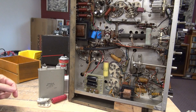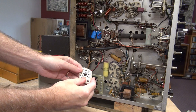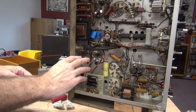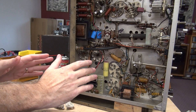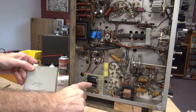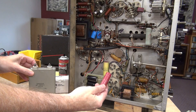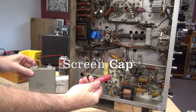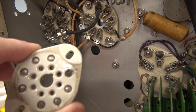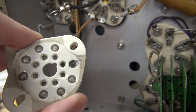In preparation to apply high voltage, I did have to replace one of the 5R4 tube sockets. It had arced and was also physically damaged. I also added insulators under those sockets to stop future arcing. The high voltage filter cap has been replaced — this is the old oil-filled type and this is a D-Lab C9 capacitor assembly. I also noticed that the screen resistor off the 807s was hanging with a broken lead, so I replaced that too. Here is the one that was removed.